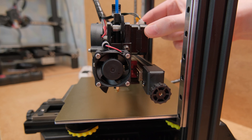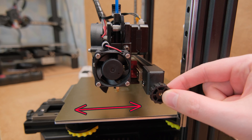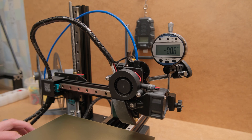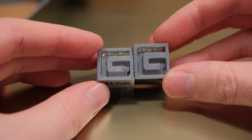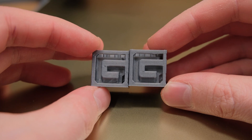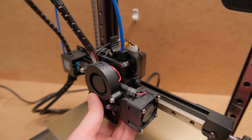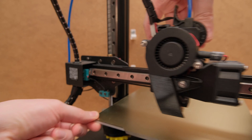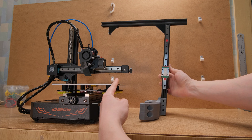The first: because the X-axis is only mounted on one end, the other end can tangle to the Y-axis direction. Second, it can also sag depending on the printhead location. How much these two things affect the actual print quality depends on how rigid the motion system design is, the Z-axis, the weight of the printhead, and the speeds. The only way to show a proper comparison is by modifying the cantilever 3D printer with an additional Z-axis rail.